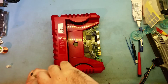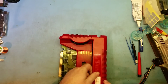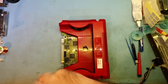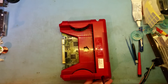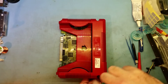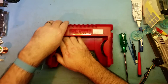If you're not good at doing soldering on fine traces and tracks, please find a friend who can, or someone else who's good with soldering. I wouldn't recommend this to a beginner, because the tracks are quite fine. The way I clean up the tracks is I use a scalpel with a 10A blade to scratch most of the corrosion off, and then I go over it with what's called a fiber brush — or abrasive brush.